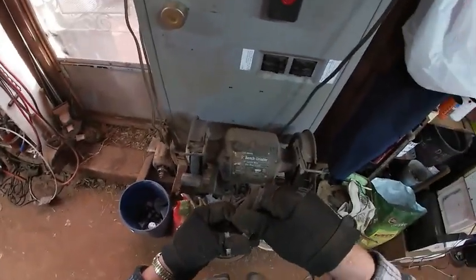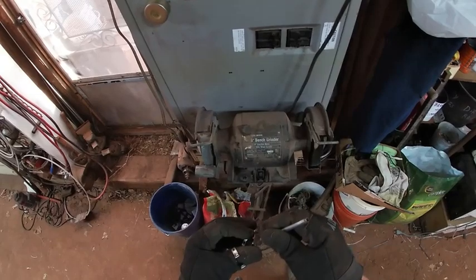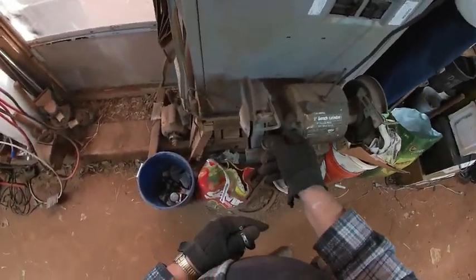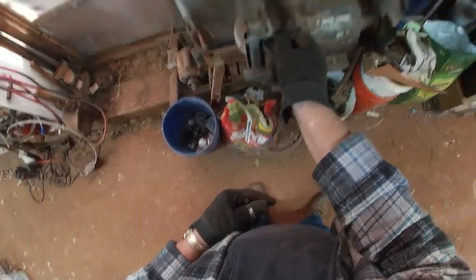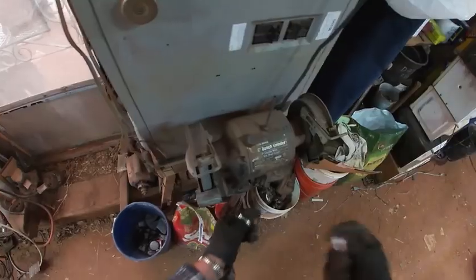For you new people that don't really know how to tell stainless from aluminum - now you got magnetic stainless and non-magnetic stainless. This isn't sticking so all I do is stick it on a bench grinder. You see the spark? If it sparks, it's stainless steel. If it's aluminum it won't spark.